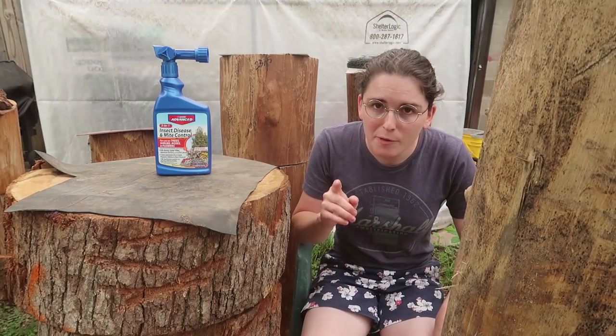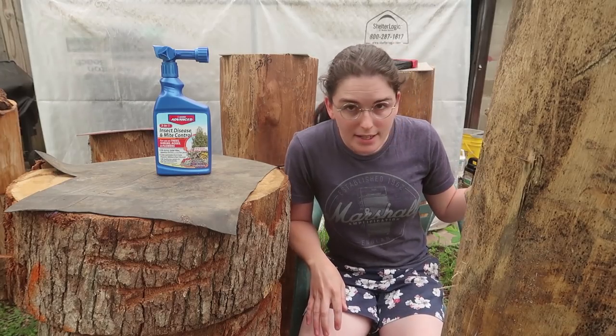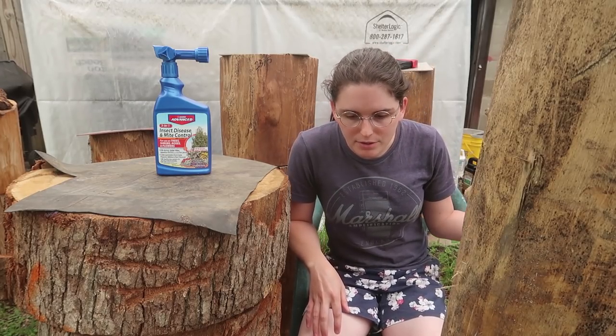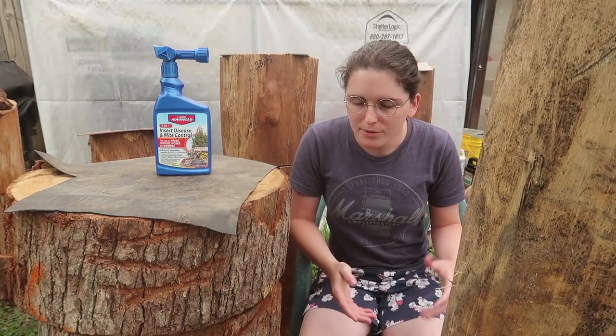If you're battling a powder post beetle infestation, then what I found in this video was that making a kiln to heat up the wood to 136 degrees on the outside, 104 degrees on the inside of the log, was enough to kill a lot of the beetles.